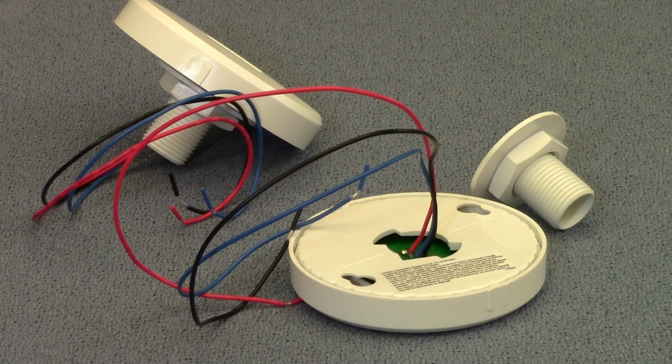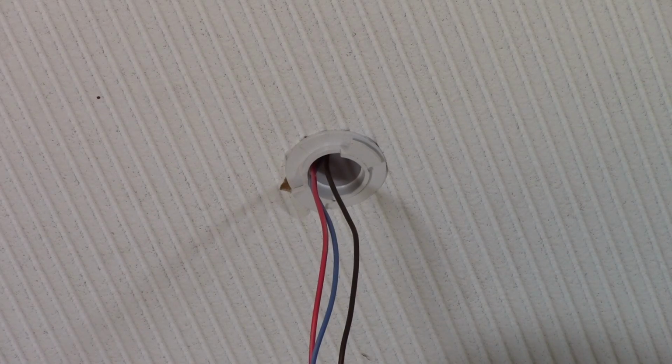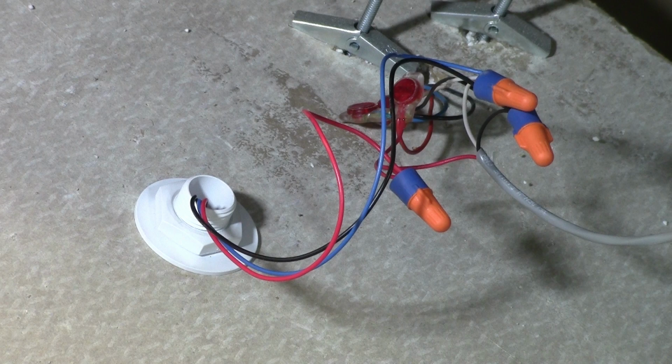Mounting of the RF signal pack is the first step in the installation process. The signal pack can be easily mounted to an acoustic ceiling tile. When installing the RF signal pack in a ceiling tile, it is necessary to drill a 7/8 inch hole into the ceiling tile. Next, install the provided threaded insert flange side by screwing it into the opening in the back of the signal pack, turning it clockwise until it locks.